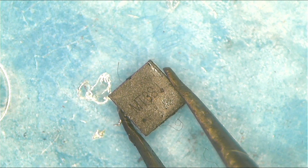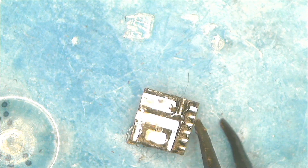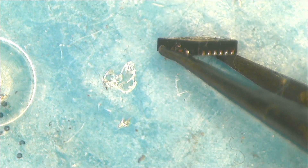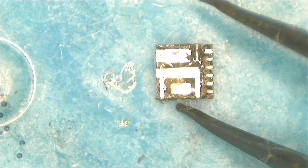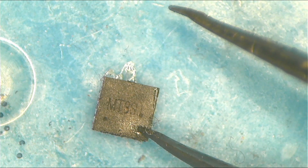This chip here — I think it's a 3.3V or 5V regulator IC — is dead. Instead of using separate MOSFETs, they now use these integrated chips to generate 3.3V and 5V. No more separate MOSFETs, no more extra controller chips — just one single chip does it all. But this one is a bad chip and has to be thrown away.